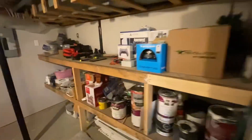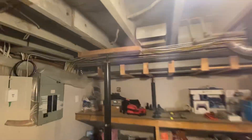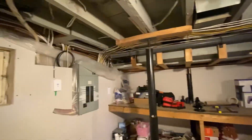This is the unused space back here where I want to put a hack squat machine and some other stuff. So I'm going to knock that down and put a couple of beams in. There's a supporting beam here, and one here. I'm going to cut the main beam out, put a six-inch I-beam in there, and then put a four-inch I-beam here so I can retain the headroom.